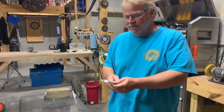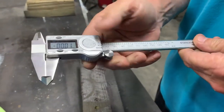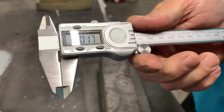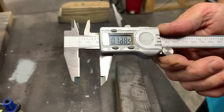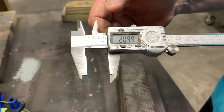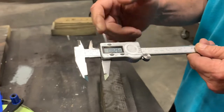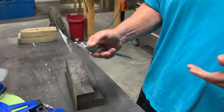This is a little digital caliper. Machinists typically use this. You can see we turn it on here, zero it out, and then do it in either millimeters or inches. Let's zero it back out, go to inches, and you see as I start to pull this out it'll give me an exact measurement. If I wanted to convert that to millimeters I just click millimeter — that's 20.99 millimeters, which is the same as 0.82 of an inch. So this gives you a digital readout used primarily by machinists and people that need to be exact on everything they do.